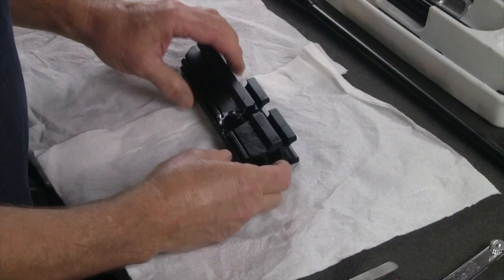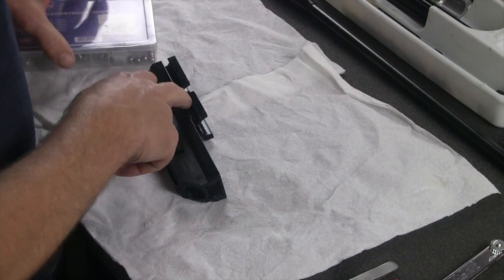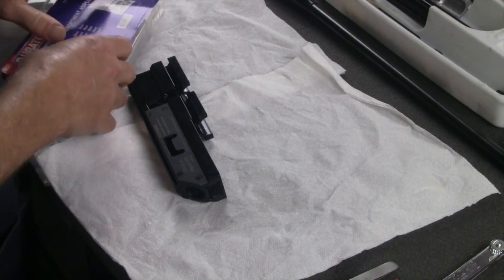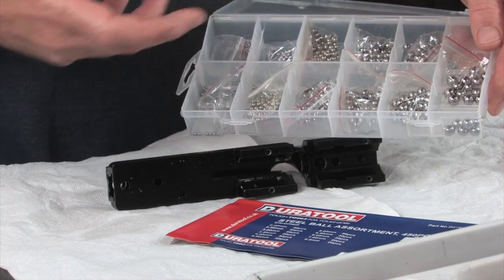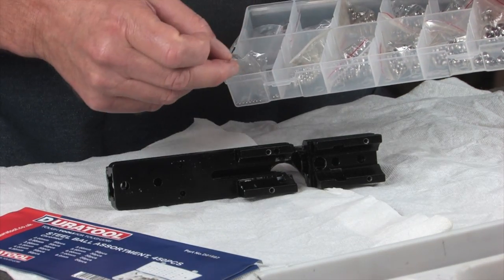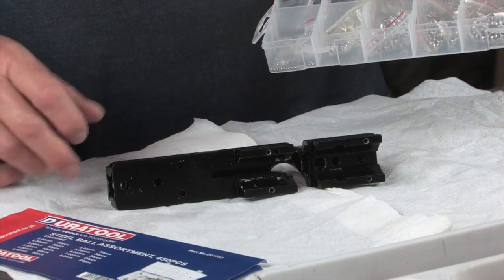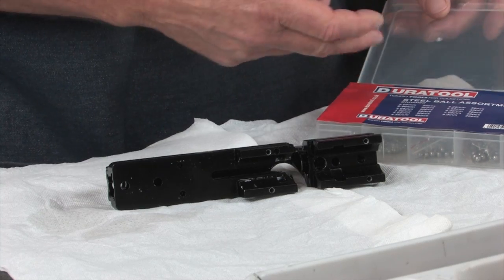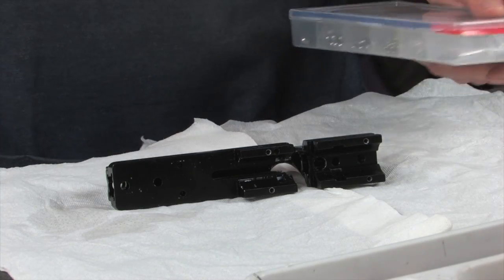There are a few things that are a little tricky about it. The one I hate the most is the little ball bearing that goes under the safety. I'm just clumsy enough to where I usually fly that all around the room. So I broke down and bought myself a package of these — it's got all the metric sizes. The one with the least number of balls is the two millimeter ball, and that's because this is the one that goes under the safety. I've lost so many that I got this pack — it's got 50 of them and I've probably used a third of them already. You would think that you'd find them on the floor, but I never do.